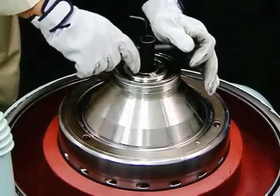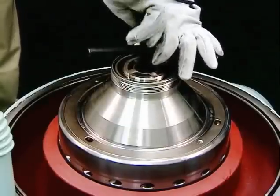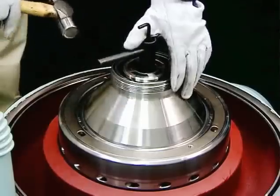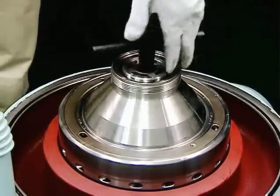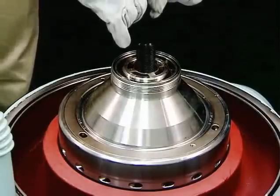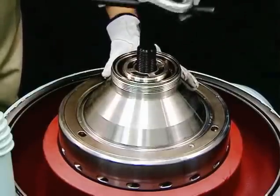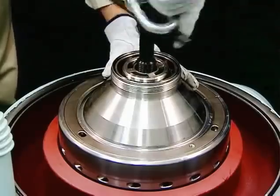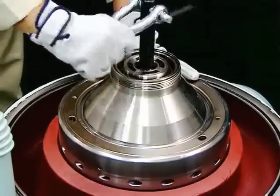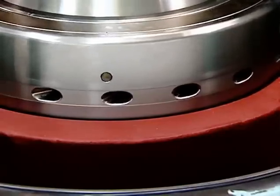Remove the bowl. First insert the cap nut spanner in the bowl and screw the release bolts into the threads on the heads of the cap nuts. Next, loosen and remove the cap nuts using the cap nut spanner. Mount the bowl lifting jack onto the guide tubes on the thread and tighten it. The bowl will separate from the vertical shaft and float up. This is done to prevent the application of excessive force to the bearings of fast-rotating equipment.